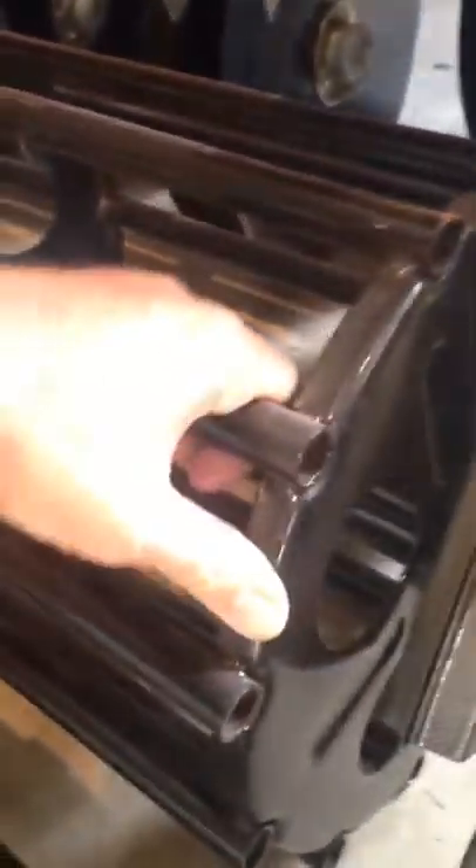This roller is the drive mechanism — this is what drags through the dirt. The pipe is thin; everything is kind of thin on this. If there's a weak spot, I'd say this is going to be it — I can see this thing getting bent up and beat up. But it drives the chain, and each side drives a different hopper.